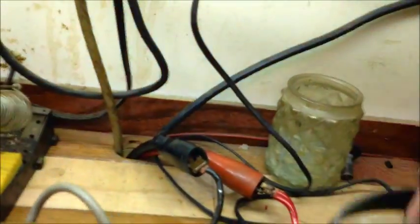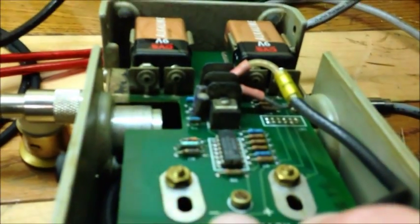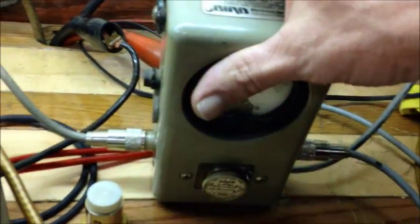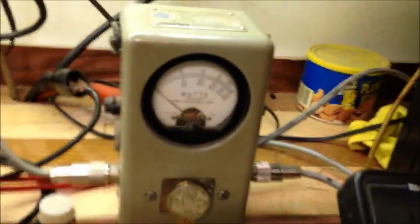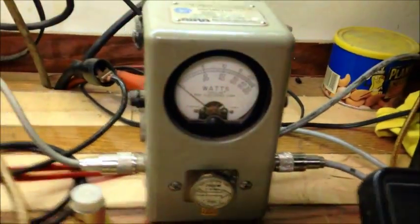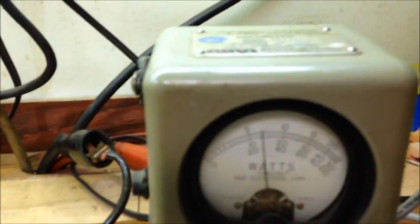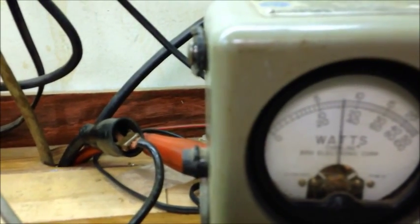Just to verify with everybody — this is a real Bird 43P, not one of those gizmos or gadgets you buy off eBay with all those little switches on it. This is actually made by Bird Corporation, a 43P meter, which I mainly use on most of my radio testing. So let's get on with it — we've got that in peak, we've got that in watts. Key down — we're almost 200 watts dead key. About 800 on the peak, and almost 350 watts Bird — I dabbed about 320. That's what we get out of this configuration.